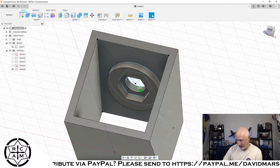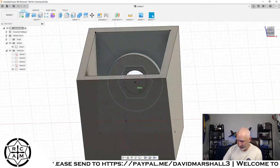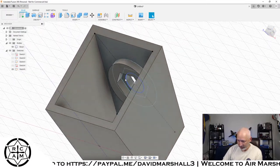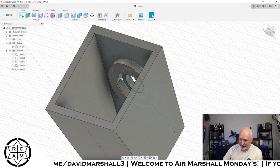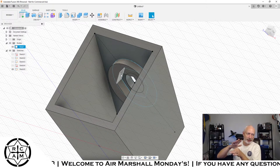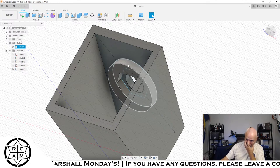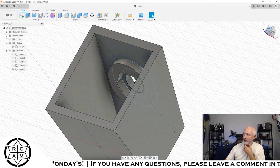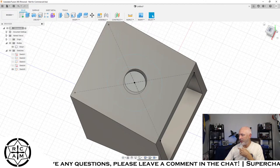And what you'll see there is on the inside of that, there is now an area that flanged hex, that hex flange can go up into. It will seat inside that area there. And the rest of the SMA connector will come up through here.